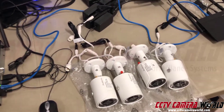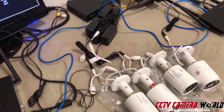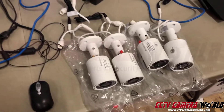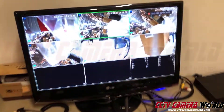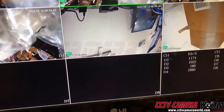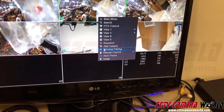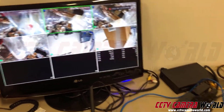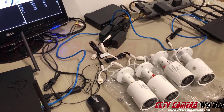The second step is to power up your Wi-Fi cameras. We recommend doing a bench test first to familiarize yourself with the system. Here I have four power supplies for the four cameras. After powering on the cameras, if you see blank screens or 'network host not found' errors, right-click and select 'wireless pairing.' This tells the NVR and cameras to find and pair with each other, and you should see images slowly appear. Give cameras three to five minutes to finish booting before clicking wireless pairing — if you're lucky, they'll pair automatically.